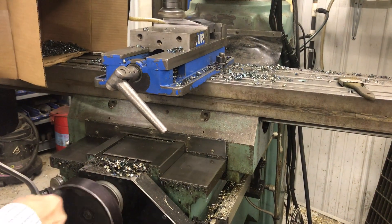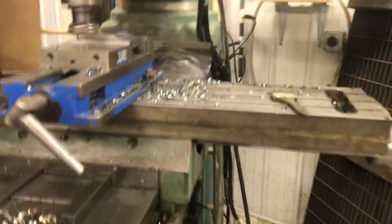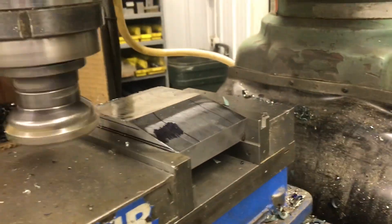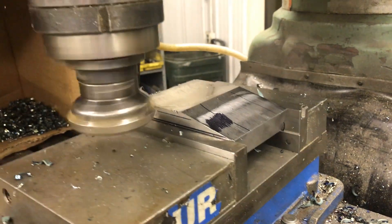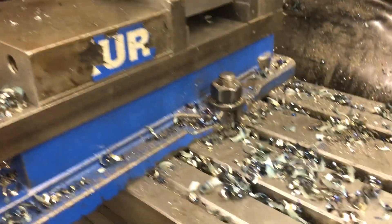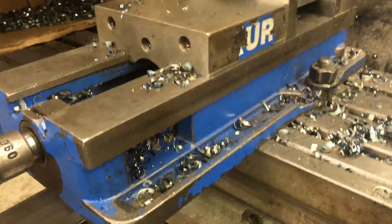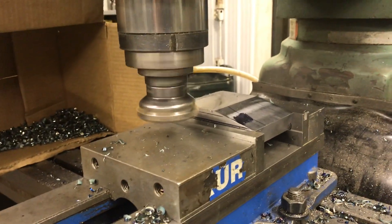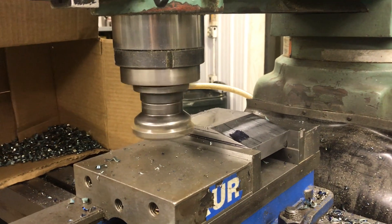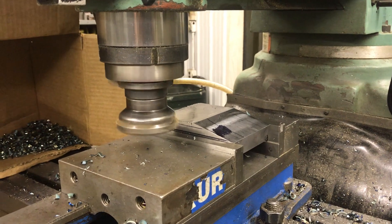Voila! We've got it done. That's a pretty hefty cut there. You can see we've taken a hundred and fifty thousandths off of there and made a real nice cut. I've got a pile of blue chips over there — sometimes those cardboard boxes start smoking! The carbides are great these days. I grew up before cutters like this were even made, and now it's easy to cut and make fast time on doing machining. Thank you.